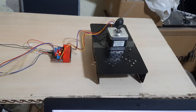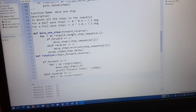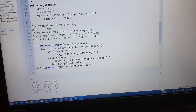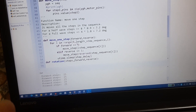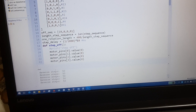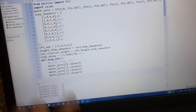It is being controlled using the Raspberry Pi Pico W and this is the code. I've written a few functions: one for the complete routine, one for stepwise rotation, and one for moving a single step of 0.9 degrees. The full 8-step sequence covers all steps in order one by one, and each complete sequence equals 7.2 degrees.